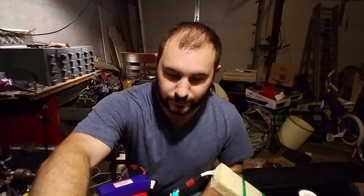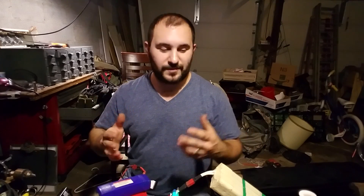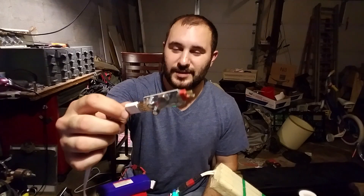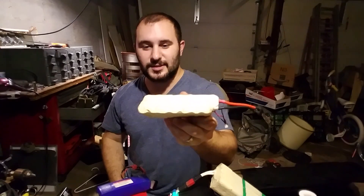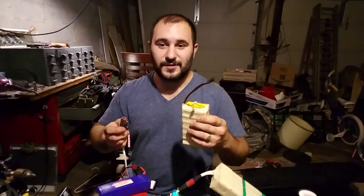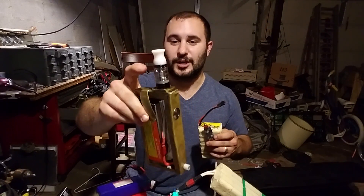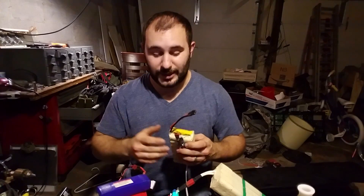If I do, I will record it and post it. In the meantime, I have all of the main electronics finished. I have USB functionality, although it's limited right now — I only have two USB ports I can charge off of, and they're both individual systems. I have my buck converter made to run from 7 to 17 volts input, 5 volt 3 amp output. This works great running it off the 2-series 7-parallel 18650 pack. This is my everyday carry — I use it for my phone, Bluetooth, and my 18650 charger. The only thing I haven't been able to charge is my lipos.